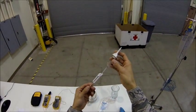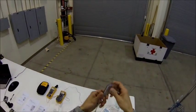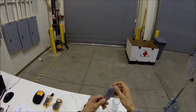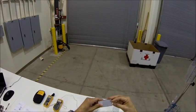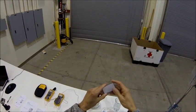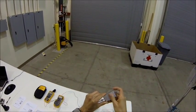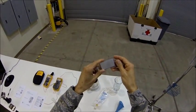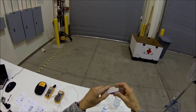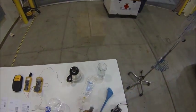You can find these procedures in the service manual itself. And you'll need to get a hold of one of the heating blocks. This is the cartridge that snaps in, and this side goes against the heating element. If you do happen to use sodium chloride solution, it's going to get all over the place, and when it dries it does leave a salt residue all over all of your equipment, so make sure you give this a good rinsing prior to putting it into the unit so it doesn't skew your temperature results.